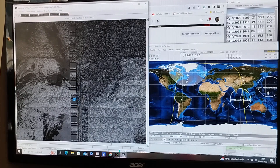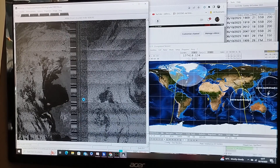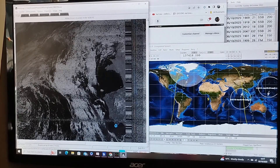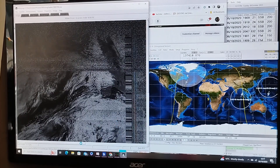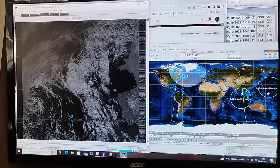Right now we're moving to the next one which is NOAA-18 — we're going to build the image on this one, currently received in black and white format. A nice pass — you can see south of Spain and got a good sweep on that one. We'll just take a look as it adds additional clarity and contrast, and then the colours to the end result of NOAA-18.